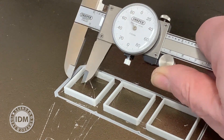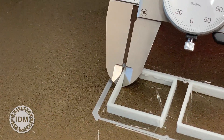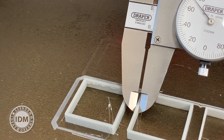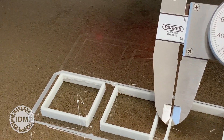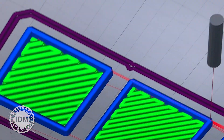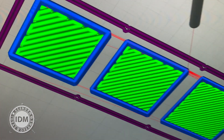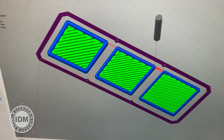The print's finished and measuring with the verniers: the widest setting is running at around 2.2mm as intended, the next at about 1.8mm, and the next at about 1.4mm — so I'm about 0.2mm off on most of them, but generally wider is what I wanted. Next I'm going to look at the bottom layers and see how good the infill is on those bottom and top layers.